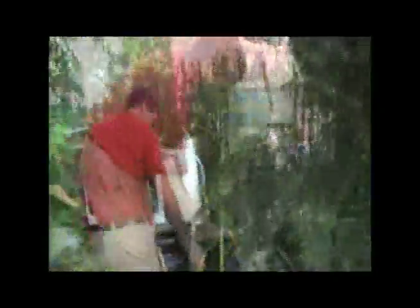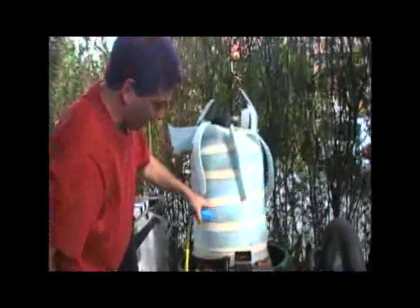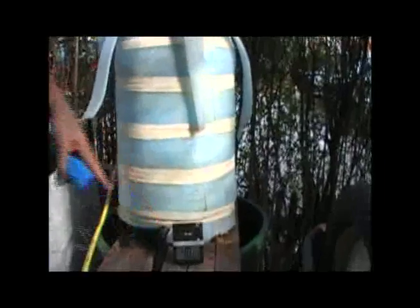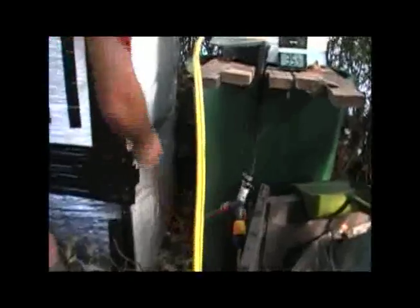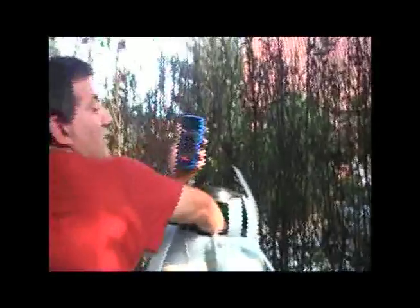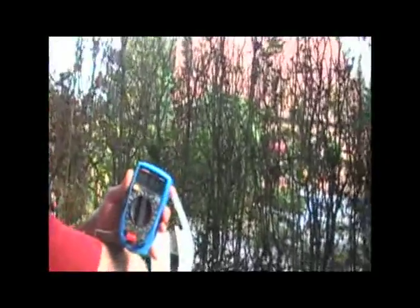It comes over here into the bottom of our hot water tank. As you can see, it's 48 degrees right now inside the composter. That 48 degrees inside the composter is taking cold water from the bottom of the hot water barrel, putting it through two radiators inside the composter, and then coming out heated up here. When I measure the temperature in the tank, you see that we've got 35 degrees — that's bath temperature.